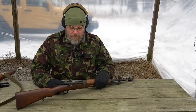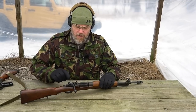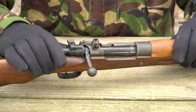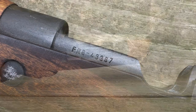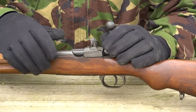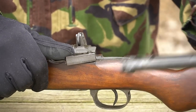Let's start by talking about the action itself. It's a Spanish M43 8mm Mauser action converted to .308 / 7.62x51 NATO. It has a straight bolt handle — not downturned like the German K98 — and the serial number on the bolt does actually match the receiver. Disassembly is just like a K98 or any other Mauser of that era: pull this little lever out with the index finger, pull the bolt back, and it pops out. Now you can clean the rifle from the breech, as you should.